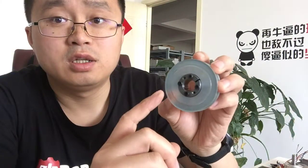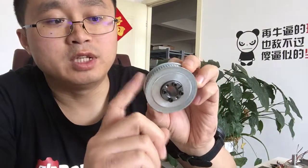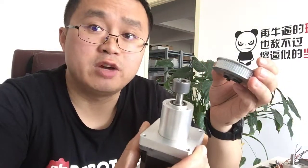That's why we use this kind of taper lock on timing pulleys — because it performs much better, especially for large torque applications. If the timing pulley is HTD 3M or HTD 5M — three millimeter or five millimeter pitch — with high torque requirements and a large motor, you need this taper lock timing pulley to ensure the pulley is mounted correctly and effectively onto the motor shaft.